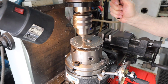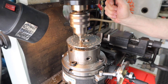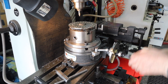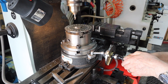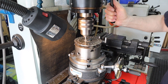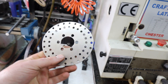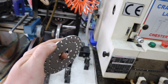Just going to drill the six holes through the middle that interact with the adapter. Because there are six holes here, that's 60-degree increments. It won't be a slow job. There we go — there is the plate that the spoons are attached to, all drilled and machined to the right size.